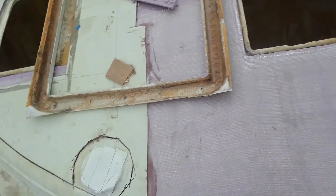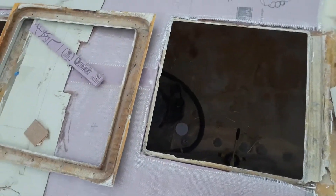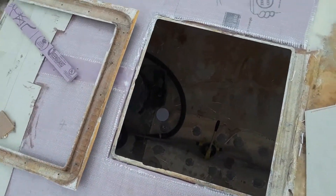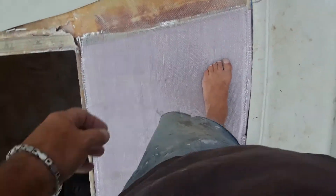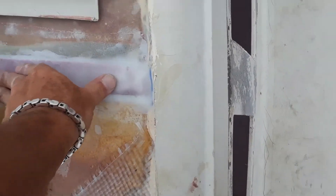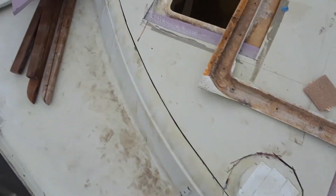That's what's going on on Aurea. Anybody who thinks you can't put pink panther foam down — if you're putting real heavy gauge cloth over it, what's the difference? It's closed cell, it's never going to absorb water. And obviously that's without the top skin on, so I think we're in good shape. The whole thing is about two inches thick of solid strips of epoxy and fiberglass cloth.